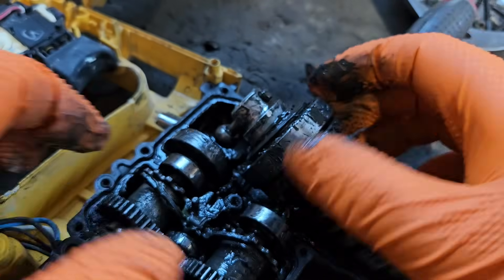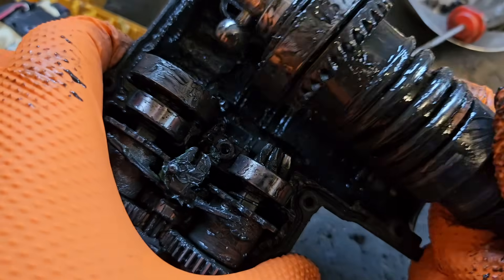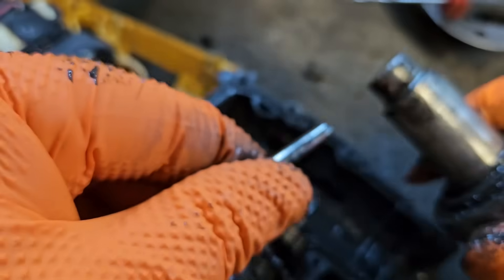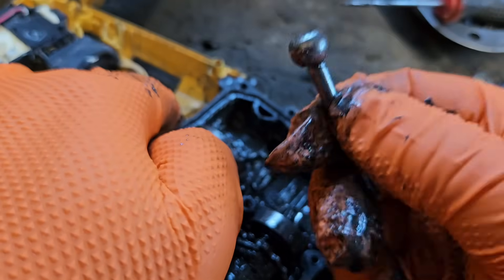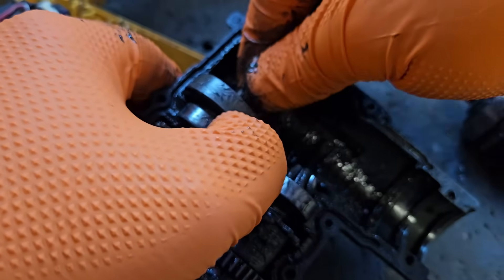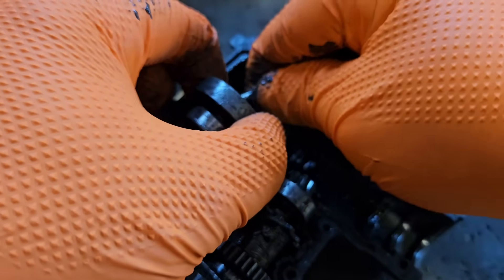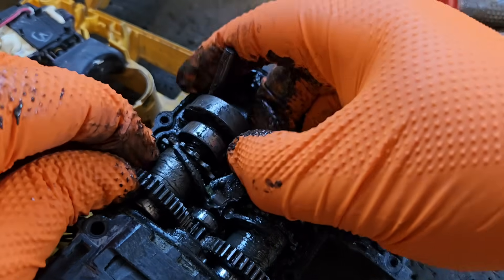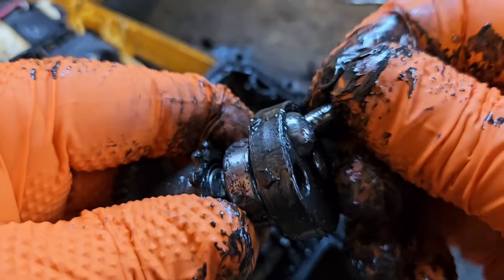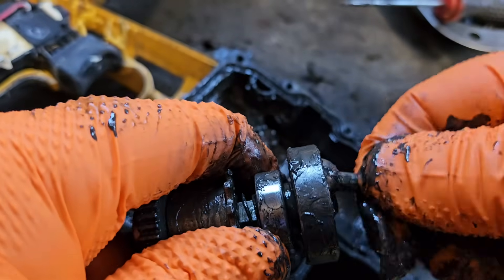The actual ball's out of place. This here is out of place. This is supposed to sit on here. I'll pull this out. That's the whole big assembly. But that ball - the spindle goes in here. And as this rotates, it causes this hammer function - bang, bang, bang. But it was out of place there. That can break as well. You can get those broken. You can get this shaft broken. And I'll show you how to service the hammer. The hammer might need service as well. So this has come out of place - we might need a new spindle. If this spindle comes out of place or gets broke, you lose the hammer function.